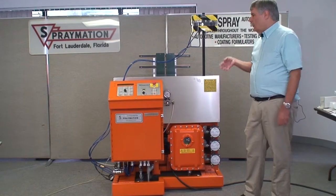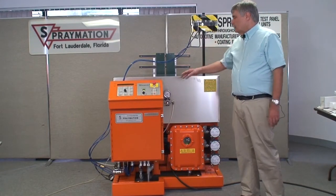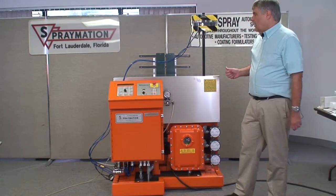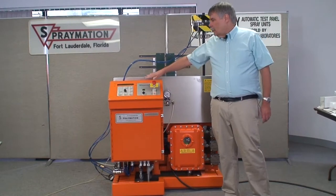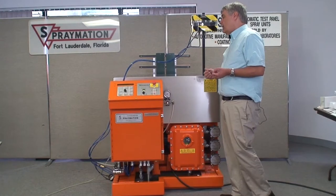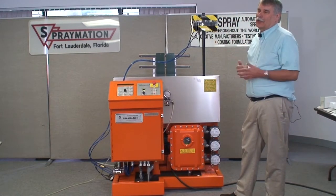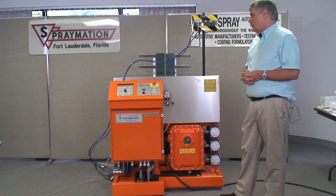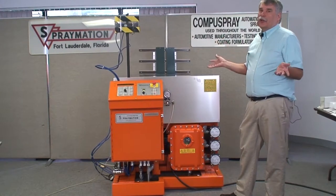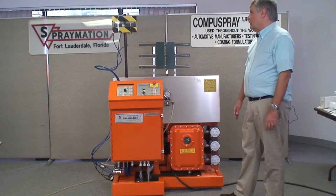As an operator you have to be aware that there are times the traverse stops moving — like right now, between coats. This script has two coats; we finished the first coat and now there's some flash time. The cycle active light is still blinking, so this machine is still armed — anything can happen. In the detailed video of the screen, you'll see how you can watch timers count down and know what's happening in the script: where you're at, what stroke you're in, what coat you're in, and other useful information.